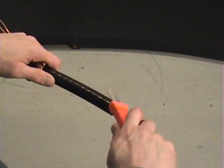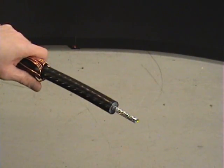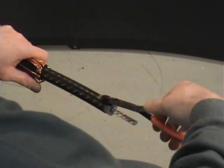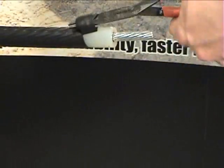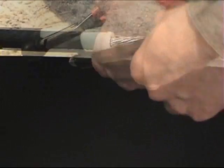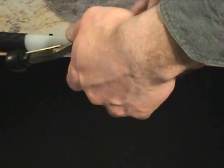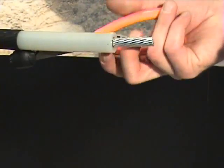Use a knife, such as the Speed Systems SC11 edge wedge, to lift the end of the SEMICON so you can grab it with pliers, such as the Speed Systems SC13. Use the pliers to roll the SEMICON from the insulation until you reach the square cut. Use gentle pressure toward the square cut and keep the distance between the pliers and the cable to a minimum to prevent tearing of the SEMICON.